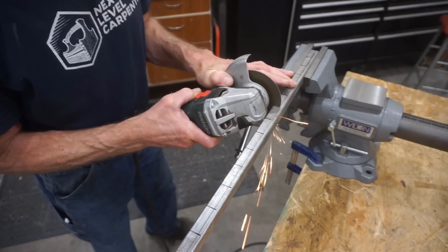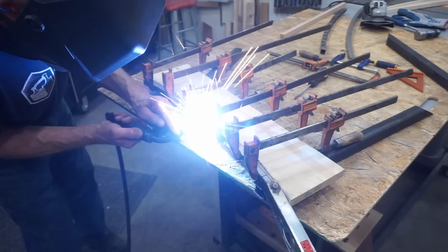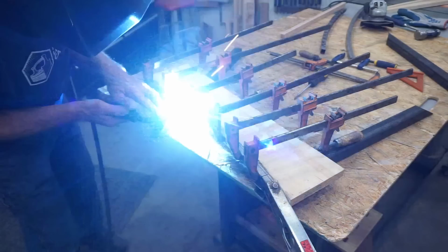It takes a little longer to cut all those cuts freehand, but the clamping and bending process works equally well as the wider kerfs, and hopefully the extra time I spent cutting I'll save when welding. Now I'm at the point of second verse, same as the first, where I apply tack weld across the gaps of these narrower kerfs to stabilize the piece at this 62 inch radius.